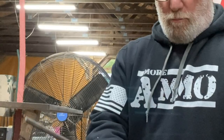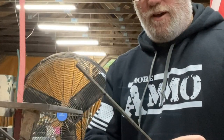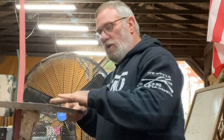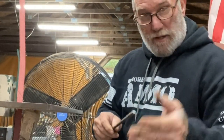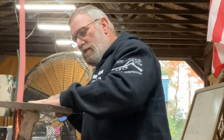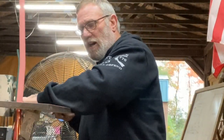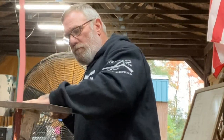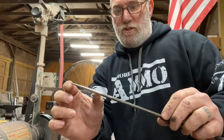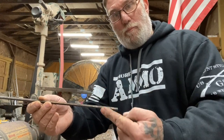So we've marked these two pieces. We've gone six and a half inches down on the longest piece — the 18-inch piece — and three inches down on the shortest piece. What we're going to do is take this short piece and roll it on this table to taper it down to a point. This is going to be our pot hook. You can put this in a drill and turn it on the belt, but I found it's just as easy with a longer piece of stock to just roll it. When we're done we have a tapered point about three inches long — this is going to be our shepherd's hook, the hook we're going to use to hang our pot off of. We'll eventually grind this side down to make our pigtail later on.